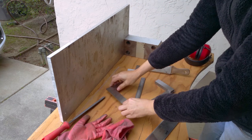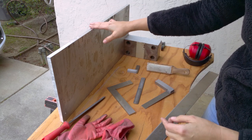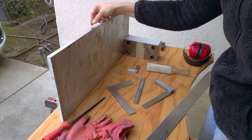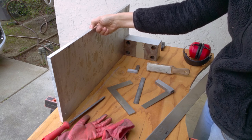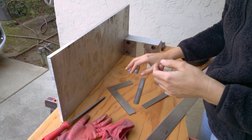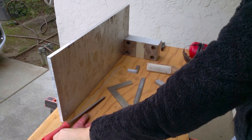I don't like listening to this sound, so I wear ear protection. I also definitely wear gloves - I don't like working with files without gloves. Looking at this top edge, if I take a straight edge and put it across, I can feel rocking and I can see where it's touching and not touching by looking where there's light through here. It's a little tight still here along here, so I'll make a mark on that.